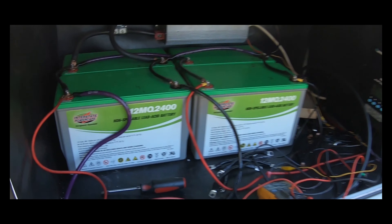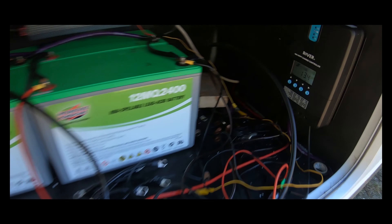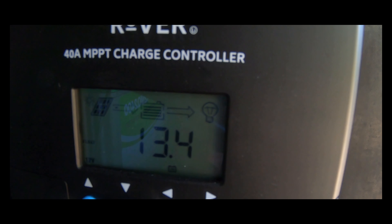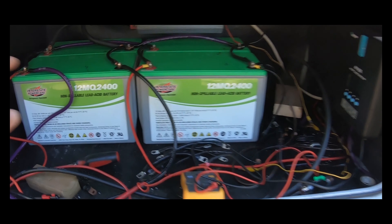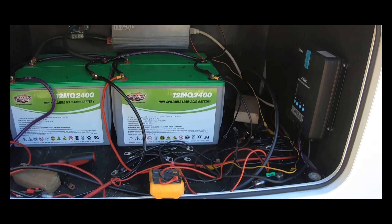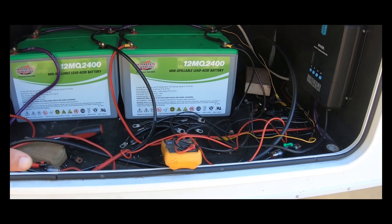After getting the bad battery removed, I went ahead and installed the four remaining batteries back in. In under two hours, the entire battery bank went to full charge in the morning sun, hit 14.5 volts, stayed there for one hour, and then came down to the float charge — you can see in the bottom corner it says 'float,' which is simply a maintenance charge cycle. So that was definitely my problem. One bad battery in the bank was just drawing all the power down. Had I not taken out battery number six, it would have continued to draw down all the other batteries, not let them reach full charge, not let them have proper maintenance cycles, and it would eventually have killed the entire battery bank.